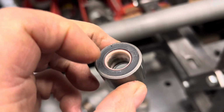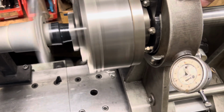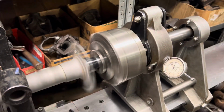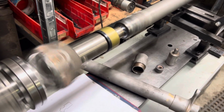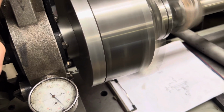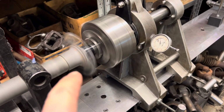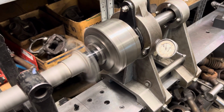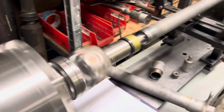That's a steel outer jacket with a plastic inner liner, and there's a layer of rubber in between. It gives it some flexibility, and it needs to have that here too, because the balancer has to be able to operate. So I fought that to a standstill so it wasn't rattly, and I got the thing tuned up now. That's cranking at about 2,500. Say that this is a win for the '37 Bugatti. It's got just a little bit of flutter right there. I was messing around with this morning, and I had it going faster than this, and I spun the tape all into a big gob, so that's contributing to that. But we're happy with the tune-up on it. It's going to run good for the Bugatti.